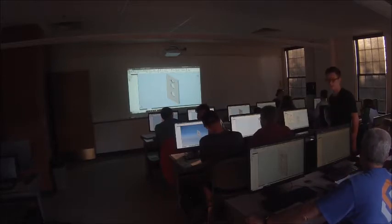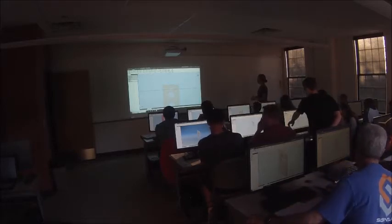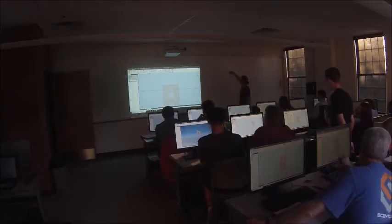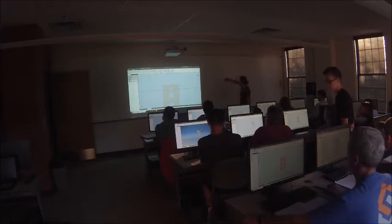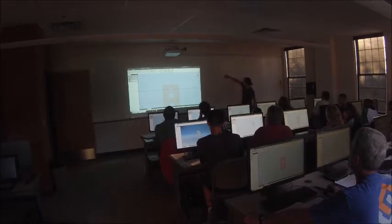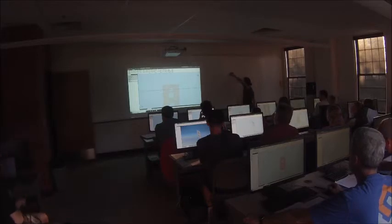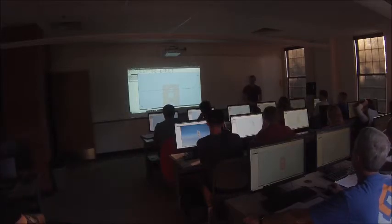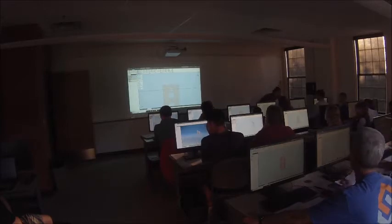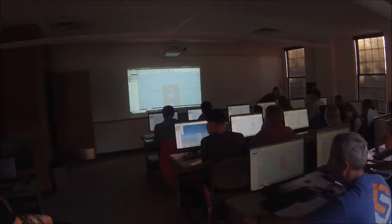Okay. All right. So create a sketch. Now, we're just going to create 4 quarter-inch holes. I don't remember what the spacing is. So basically, around this hole, we're going to create a quarter-inch hole. How we're going to do this is we're going to create a construction rectangle, a center point rectangle. So create a sketch like I did, go up to rectangle, go to 2 point center, third one down, turn on your construction geometry.